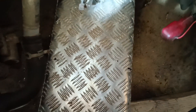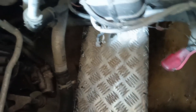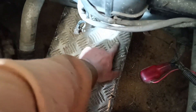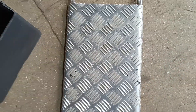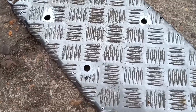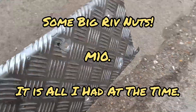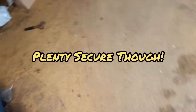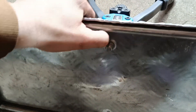I think I'm going to riv-nut it, but I'll have to take it off to riv-nut it. The holes are now drilled. I'll take it off to riv-nut it because I don't know if I can get a riv-nut in there — not back there, I'd be at an angle for sure. I'll drill it, riv-nut it, and then flat so the riv-nuts actually sit on there flat. There's one lovely riv-nut done — nice and strong, very nice and strong, solid in there. Three more to go.